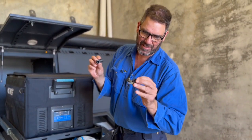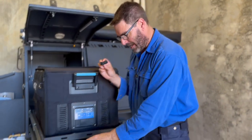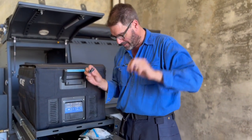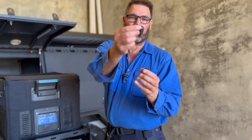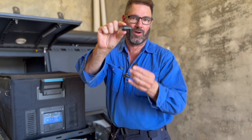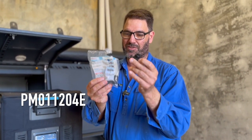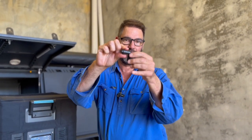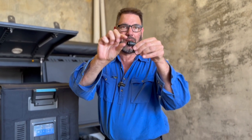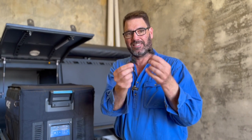They look like that — I use these C clips, I think these are about 16 mil. Just get one of those and clip it right up to the high bit. And then after you've coiled it and it gets to the top, you need to get one of these babies. So the stem goes onto the end of the coil — the same fitting that you had before — and then that stem pushes into this, which is a male fitting to the 12 mil. And that number for this baby here is PM011204E. So once that goes on the end, the coil goes on, stem goes on there, that pushes on there, and then that's when you put the other clip — and that clip goes to the back of the fridge slide. And then that bit there should go onto your existing 1 meter stainless steel flexi. So that's all you need — you can get those from Kamek or just order them online.